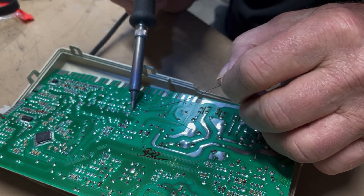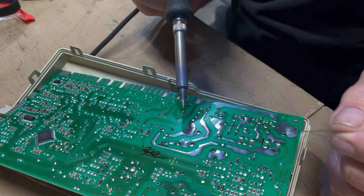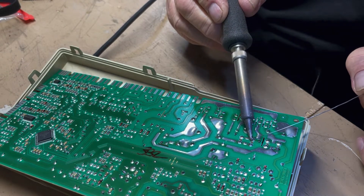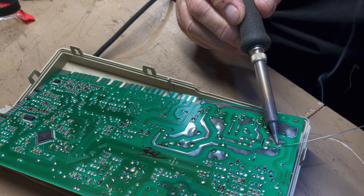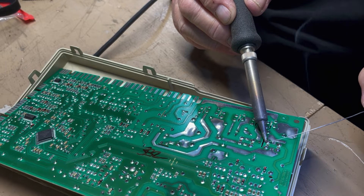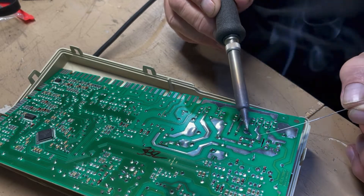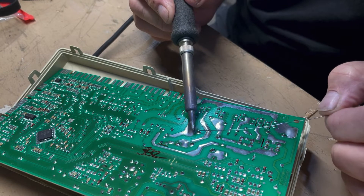Remember, don't apply too much heat or you'll curl the foils — these things here are called foils — and then you'll be in trouble and you can't do anything. Also, don't do too many in one area. Like, if it's a relay and you do four of them and there's four connectors on it, the heat could cause it to just fall through. Don't do that.